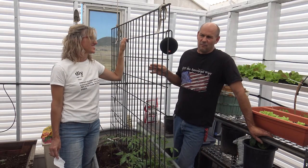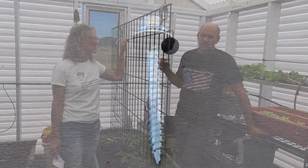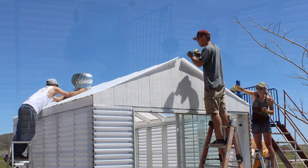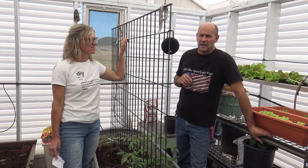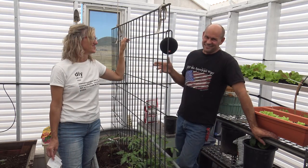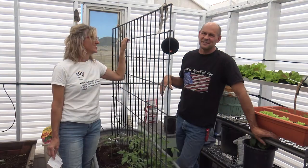For screws we bought polycarbonate panel screws from Home Depot — they also work for metal roofing. We skipped pre-drilling; a lot of videos say to pre-drill but I tested a couple and they didn't split the polycarbonate at all — they just ran right through. When you sink the screw, there's a little rubber gasket on it. You drive it down until you see a slight flex or mushrooming in the gasket, then stop. Super simple — my daughter and son ended up doing pretty much all the screws themselves.